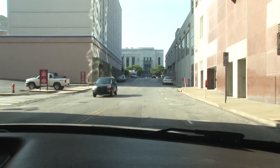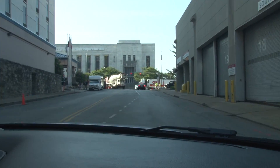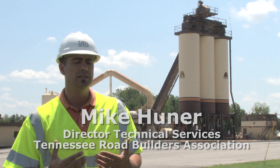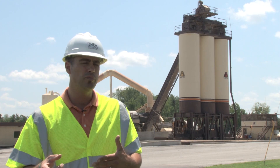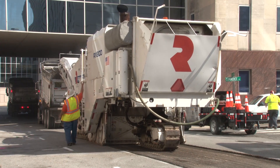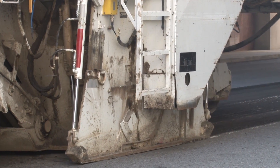A lot of agencies may go in with other treatment types where they're just trying to seal up the surface and stretch that pavement out for a few more years. In this case, the thin overlay treatment can do that. The mix we're utilizing is a very tight mix that seals up that surface, and it's a very economical approach — we can go in and mill off just a little bit of the unevenness from patching and distresses from it being a city street, then put down that thin surfacing to seal off and return the smoothness to that pavement.